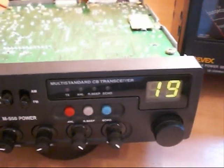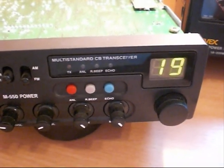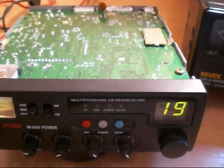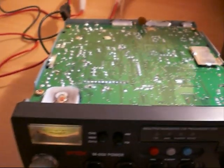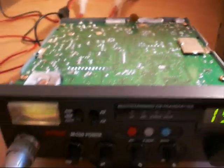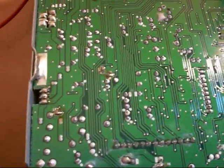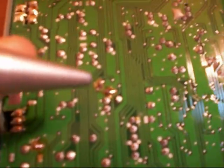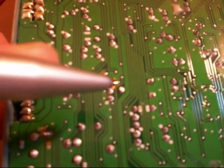You can do a modification internally to get them up to around about 10 watts. I've modded a lot of these, and in my experience anything from about 9 to 12 watts can be achieved with a little bit of tweaking. What you have to do is take off the top cover, and down here — I'm just going to show you with this pen — we've got some jumpers that need to be bridged: LK2, LK5, and LK6.